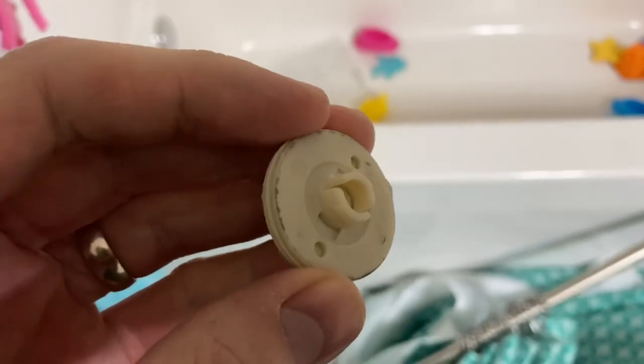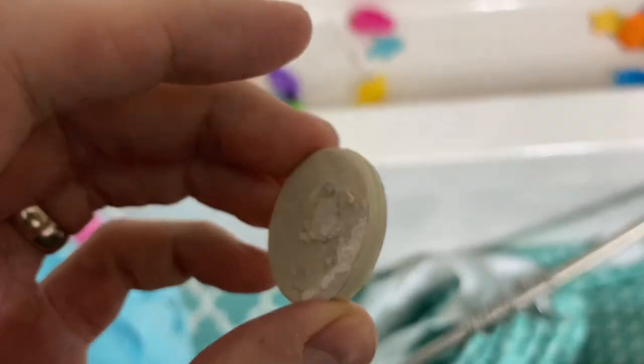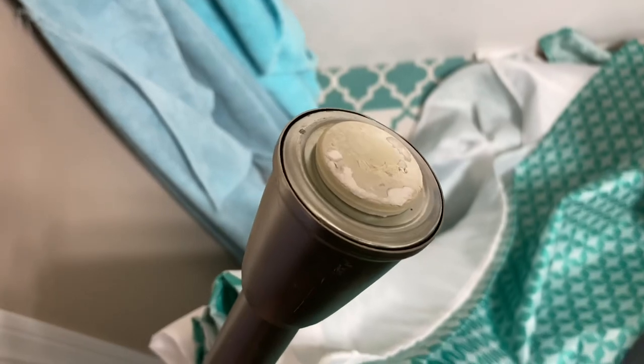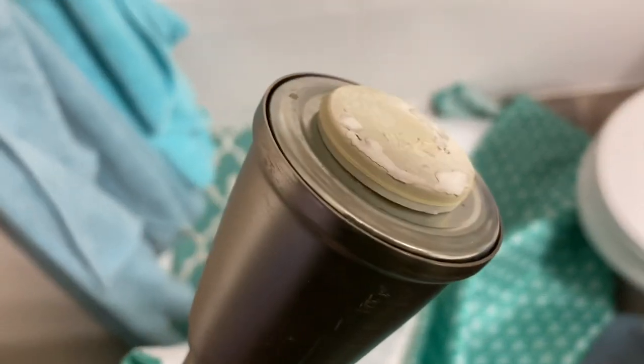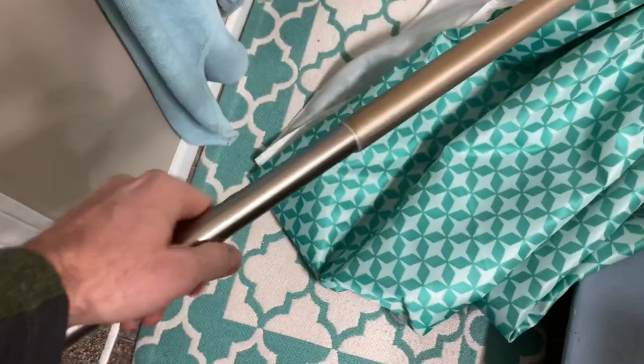This thing fell and it's been up for about four years, so it did a pretty good job. But the caulking I had put on the end of it to act as an adhesive just kind of failed. If you are going to use caulking, make sure it's paintable — not the silicone stuff — or you might have problems painting the wall later.